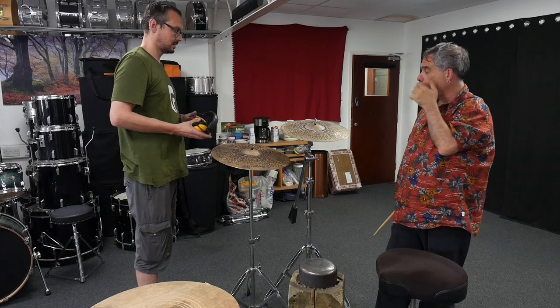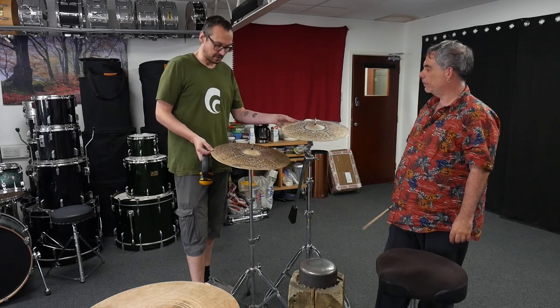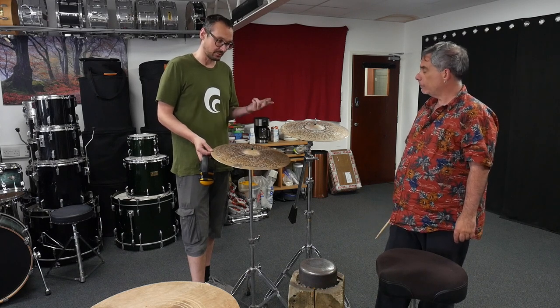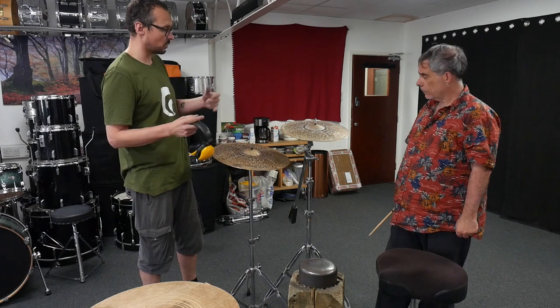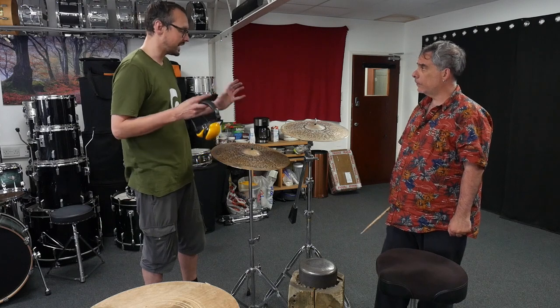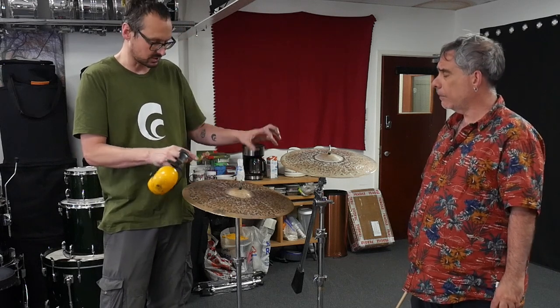We're ready for the lathe. We've done several rounds of hammering. We've spent a good few hours hammering these cymbals. Yes, you have. Yeah. We have. You both have. So, they've had hammering for strength, hammering for shape, and of course, first and foremost, hammering for sound. But all those things are the same thing anyway. And they're at a state where, like I said before, they're going to sound choked, but what you should find is there's kind of a refinement to the sound, and there's a hint of what the cymbal's going to be. The breath that you're going to get in the final cymbals will be in there somewhere. The cymbals are in there, we've just got to tease them out.